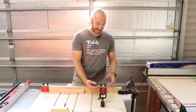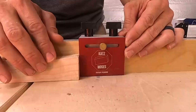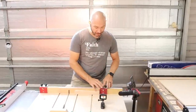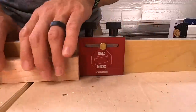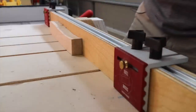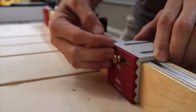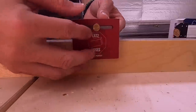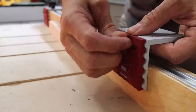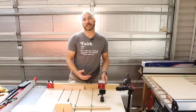One of the unique things about the Katz Moses stop block is it has micro adjustment. If the piece you cut is just a little bit too long, all you have to do is micro adjust it, barely move it, tighten it back down — it's not going to move. Now it's dialed in accurately without fumbling with any of the big knobs. You get up to one inch of micro adjustment. It'll also fit multiple size fences — a miter saw station for example — fitting anything from two and a quarter to three and three quarters tall. It has positive stops every half inch; take the brass screw out, adjust to the height you need, tighten it back down.